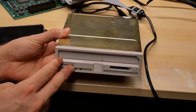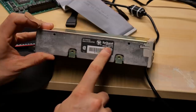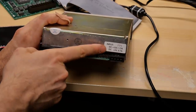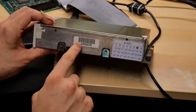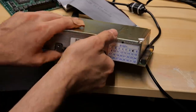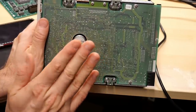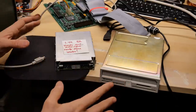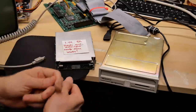If anyone has any ideas where I can pick up some 44-meg or 88-megabyte SyQuest cartridges, let me know. The model number is SQ5110 — made in Singapore. On the back: DC input, 12 volts and 5 volts, and there's a warranty void seal which is not broken. On the bottom there's a plastic cover over the PCB but there's this little motor — the spindle motor under the cartridge slot. When you slide the cartridge in, this is what spins the physical disc. Thank you very much Ed for sending in that hard drive, floppy drive, and SyQuest drive.